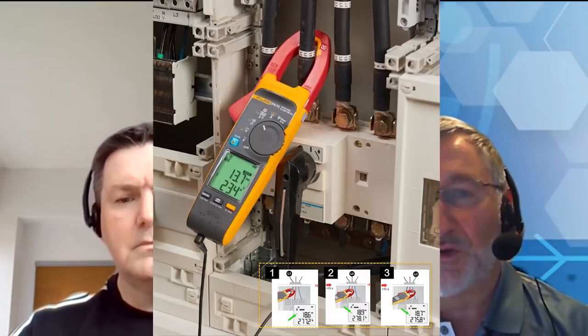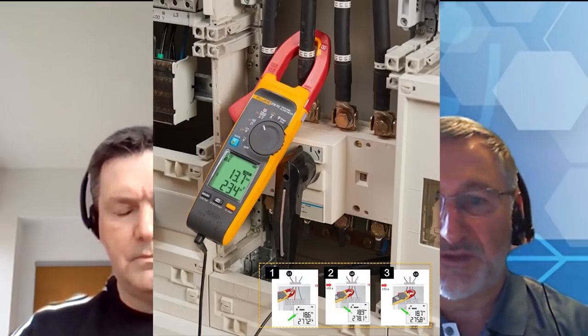So if we can take the current and voltage measurement simultaneously, if I start to think about three-phase systems, does that mean I only need to take three measurements to measure a complete three-phase system — one for each of the individual phases? The three-phase measurement measures current and voltage at the same time with the clamp. You just need to put a reference to Earth, then move from one conductor to the next to the third — measuring phase L1, L2, and L3 voltage and current in three steps. This reduces the time significantly compared to the traditional 10 or 11 measurements.